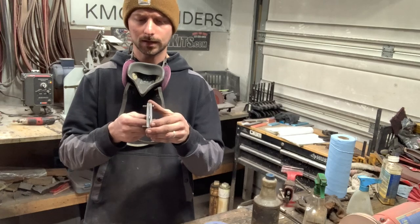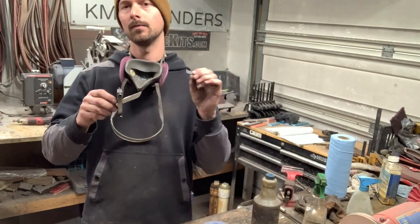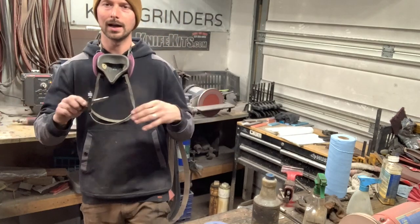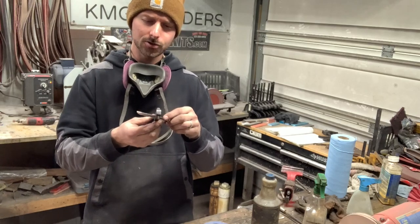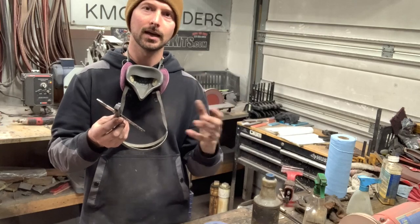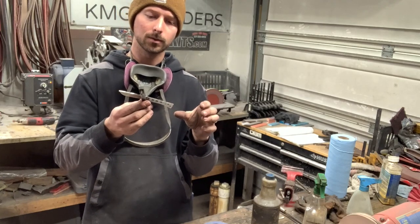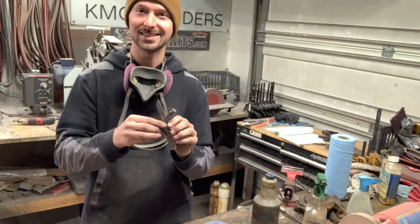And that will give me a clean enough finish to start my hand sanding process because this is Damascus. If you guys are doing a normal mono steel build, you can finish this however you want and you can grind your bevels however you want. I'm just showing my process of doing this Damascus build to show you guys again how easy it is to work with Damascus. And I wanted to have that all relate with this. So let's jump over to the grinder, throw a fresh Red Label abrasive 60 grit belt on there and wish me luck. Let's see how this goes.